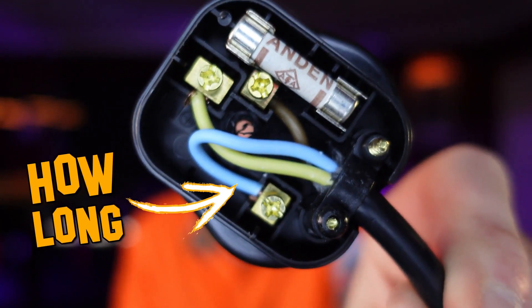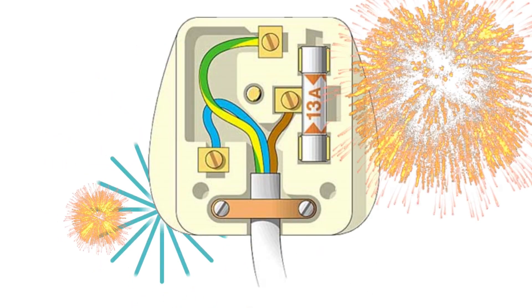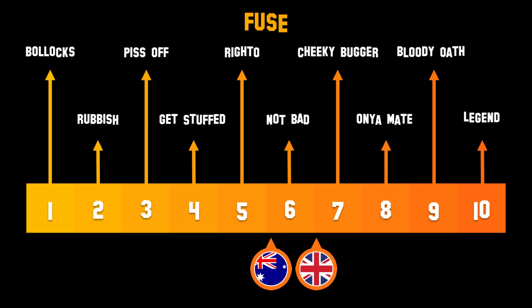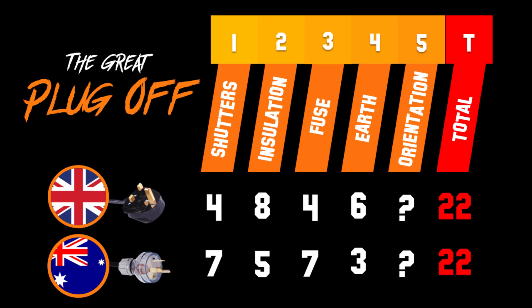Here's one I prepared earlier. Look, I know I'm a couple of cans down, but there was nothing stopping me wiring that neutral longer than it needed to be. Maybe you think this is an extreme example, but a quick search on how to wire a UK plug shows this is a secret that nobody still knows about — and a non-compliant one at that. I'm actually in favour of this feature, and at least the UK plug top has the ability to have a longer earth — something the Australian plug doesn't have at all. So I'd like to see a more deliberate design ensuring the earth is definitely the last connection. Because the Brits gave it a red-hot crack, I'm giving them a 6, and I'm giving the Aussies a 3 for being lazy bastards. At the end of round 4, it looks like we've got a dead heat.